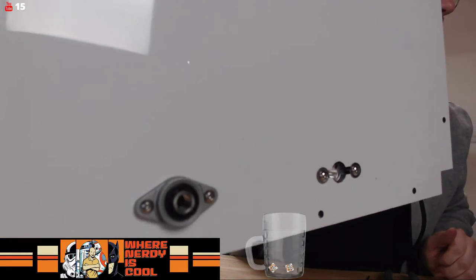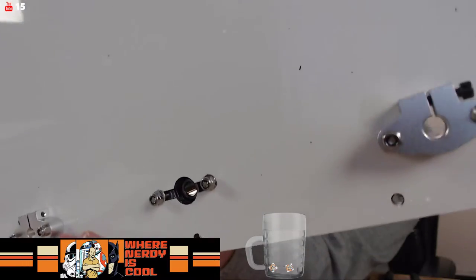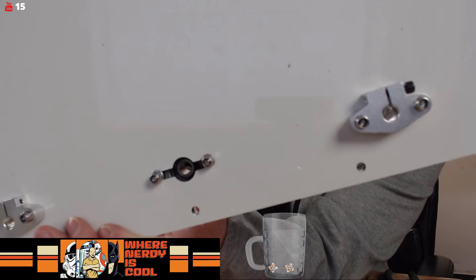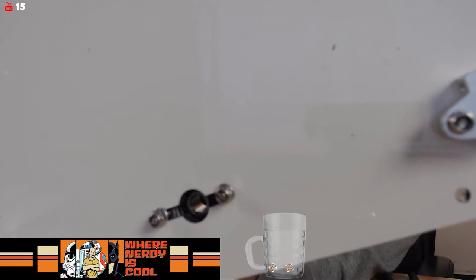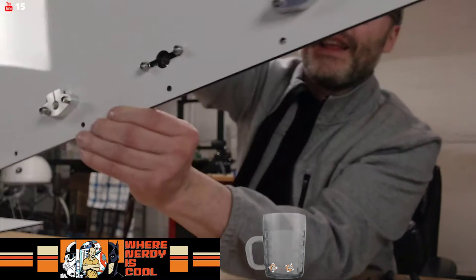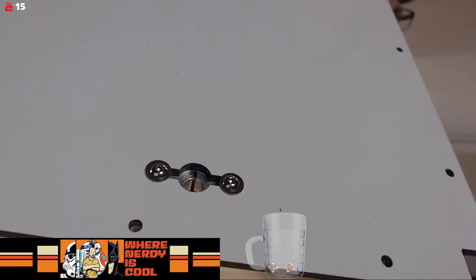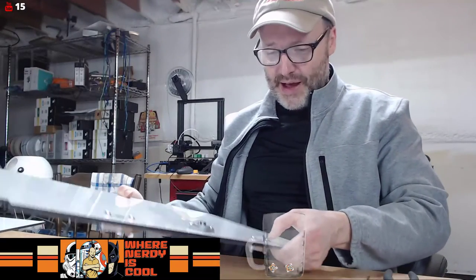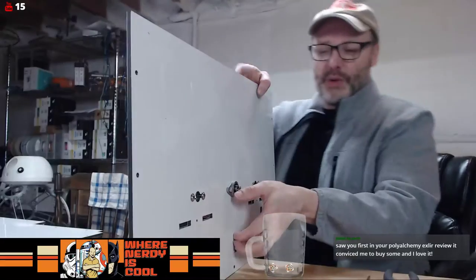Okay, so if it's done correctly, there it is. Screws in the top, and at the bottom, what I've done is, and you may be able to see it here, if I lift this up above my watermark, there are the nylon insert nuts. You may be able to see if I get this close enough without whacking the camera, I do have the lock washers under there. There you go. Focus. So again, my thought is I'm just trying to protect the ACM. I just don't want the screw head or the nuts to punch a hole in this. Not that I think it can, but, you know, my FT-5 is a grand adventure, so I have to correct my boo-boos on this one as well.